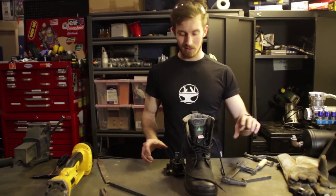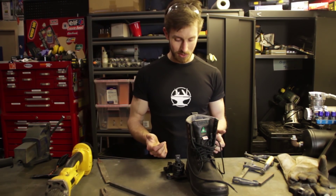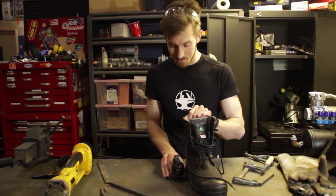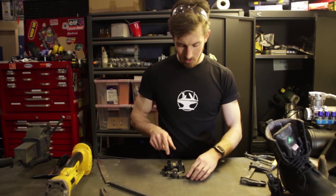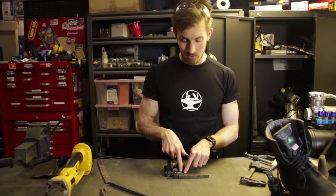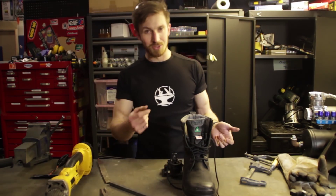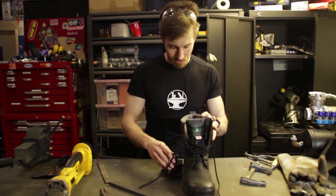We still need to build up a bit more structure, but you can see how modular this is really going to be. You can literally just plug in your pneumatic cylinders and bam — you can lift 1,600 pounds. The next step is welding a chunk right here. I'm just going to grind off the edges a bit to give me a bevel so I can really fill it with a nice strong weld. When you're on here, it'll be like you have about a half inch heel, which really isn't too bad. You'll be able to push forwards a little bit and it'll be fine.